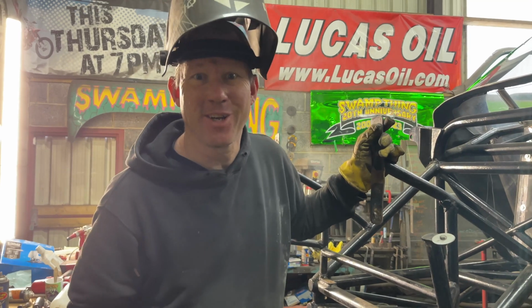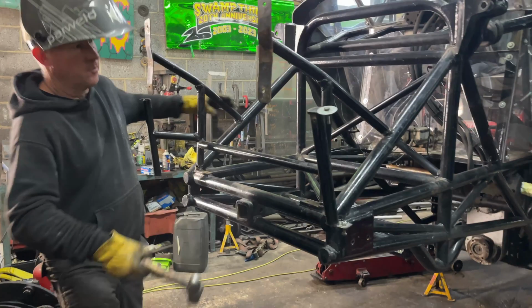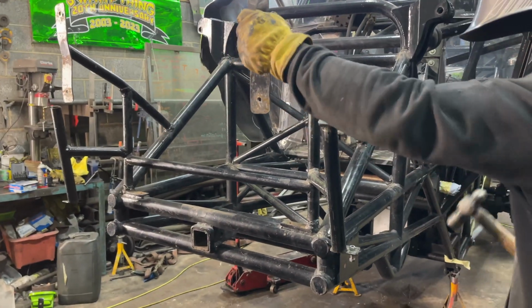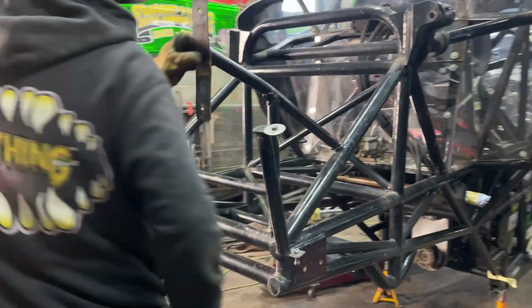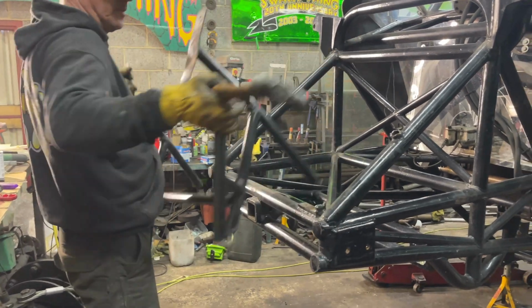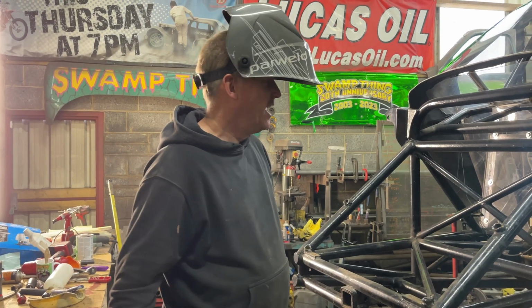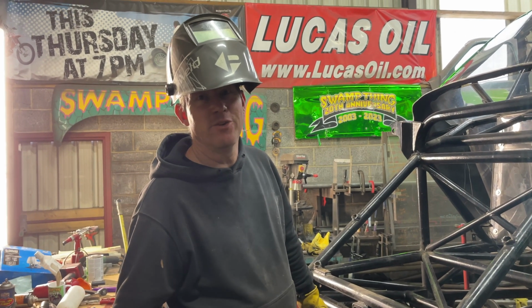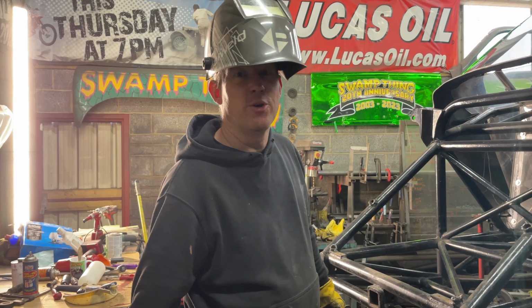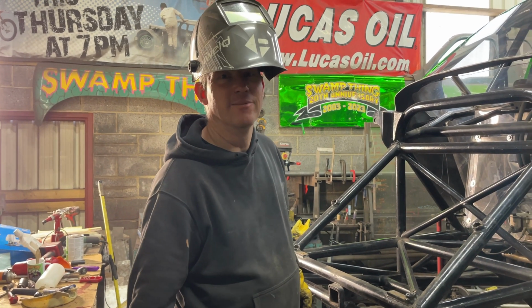Big hammer, and it should come off. Now, the reason I use a plasma cutter to cut it off is because it's been rolled over and crashed. If you use an angle grinder, what happens is it pinches the blade. So if you just cut it off like this, you can use an angle grinder to clean up afterwards with a flat disc on there.